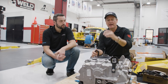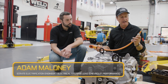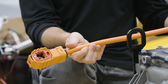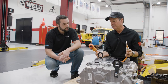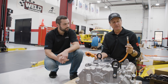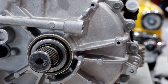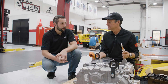We're here with Adam from GM, checking out the motor that's going to be going into the car. People don't quite understand the voltages involved. This is one of the cables for the four batteries — it's a 400 volt system, and this cable itself is 70 millimeters squared, so it's a pretty big cable. It's also a shielded cable, which helps with electromagnetic interference escaping and also serves as a safety feature when you have that much voltage moving through a steel car with people on it. This is also why the batteries have to be liquid cooled — they have their own cooling system. These are a lot more powerful than the battery in your phone or camera, and because of that they need extra safety measures.